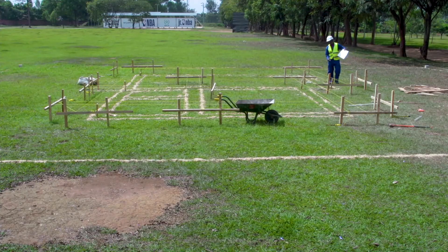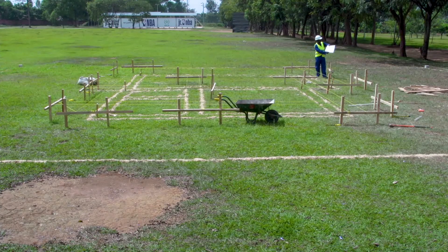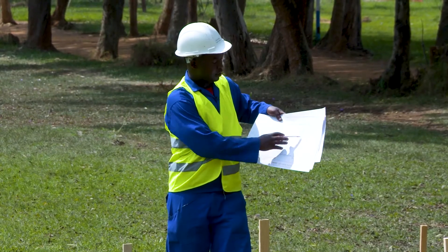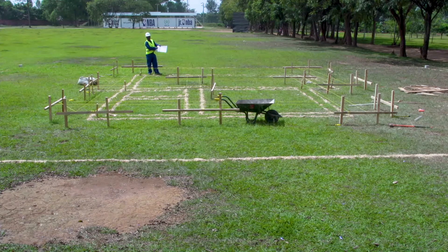This is the baseline. From this baseline, we established line AG — from this corner up to that corner we established AG. By looking at the measurement, we put a right angle here using a steel square. So we maintained this baseline, and then we stretched so that we put a right angle to establish this AG. From corner G, we want to establish another corner E. So we maintain this AG.